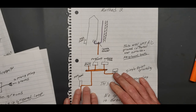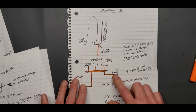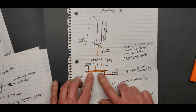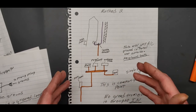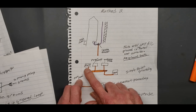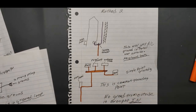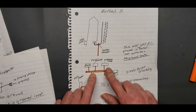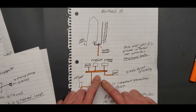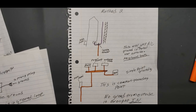There are some things you're going to interfere with. It'll always happen, but by connecting all your radio, power supply, antenna tuner, your amp, whatever you're plugging in, using strap down to a single point, that is basically pulling your RF out. Then you're going to have chokes. You should have a choke on every coax connection. At least I'm going to. I have to. It takes the noise away. I live in an apartment and it's just noisy as hell. So you're getting the neighbor's stuff and the other neighbors and what have you. I had to learn about ferrites and beads and chokes and what type of material to use and all that. But most of this RF stuff is associated with the high frequency range because they're running big power up there.